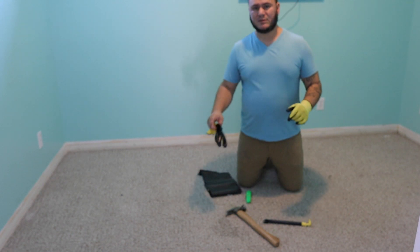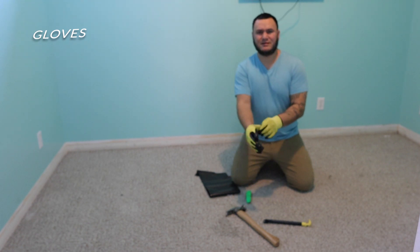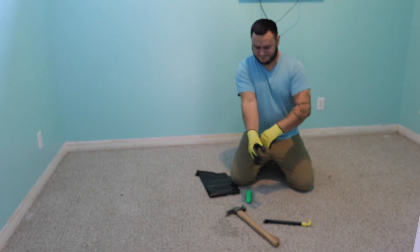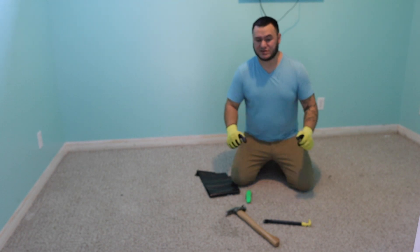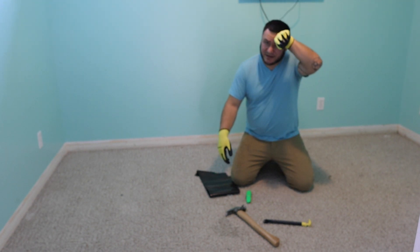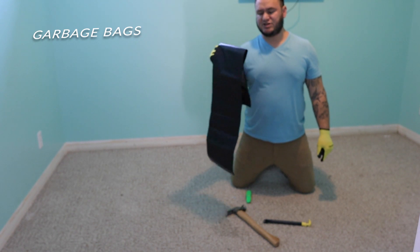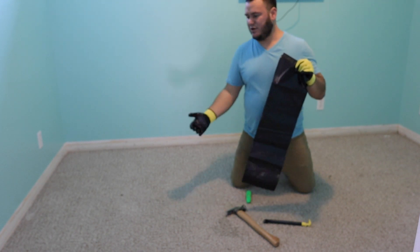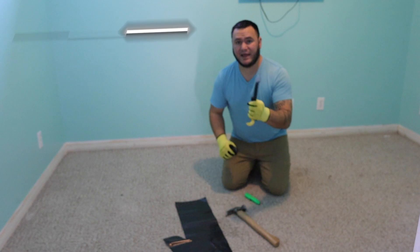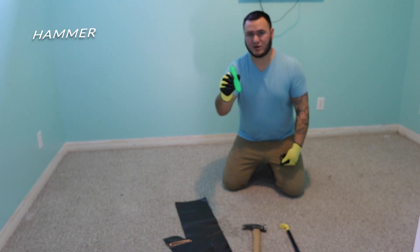For this video you're gonna need a few things. I prefer gloves just because carpet's dirty, carpet pad's dirty — you don't know if they had pets before or really what you're gonna find when you pull it up. There's a concrete floor under this, not plywood or sheeting, so your skin might be a little easier to clean up. You're gonna need a big black construction garbage bag, a cat's paw or a flat bar, some kind of hammer, and of course your utility knife.